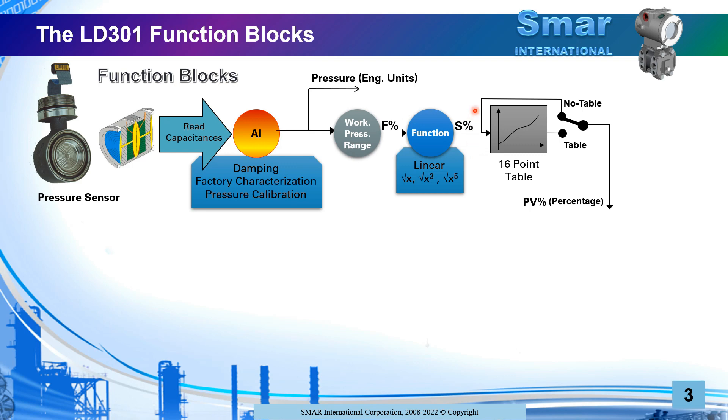After you have the second percentage value, you can either bypass or go through a table with 16 points — 16 X and Y values in percentage — where every input percentage can be converted to another output percentage. For instance, if you are measuring pressure in a tank to determine the volume, and the tank is spherical, if the fluid is in the middle of the tank the pressure is at 50% from bottom to top. But at 25% of the height in a cylindrical tank, that does not reflect 25% of the volume — it's way less. You would need to apply a linearization or compensation table for that.